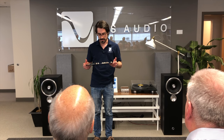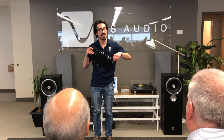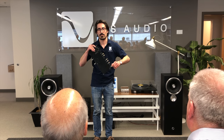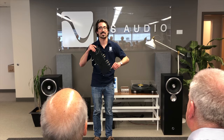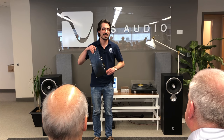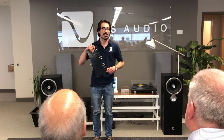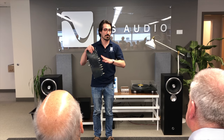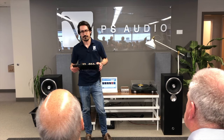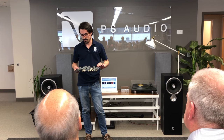And I started to simulate those, thinking that it wasn't going to work too well, because you don't see single-ended output stages in op amps. And with a lot of bias, they work extraordinarily well. And you don't have any crossover distortion. It's purely Class A no matter what. And it's a part of creating that really linear open loop path that I was talking about, which is really the fundamental approach with this thing.